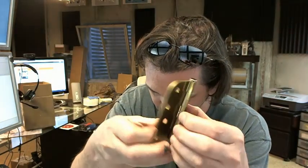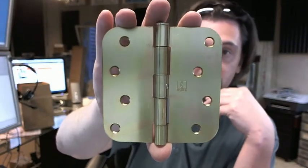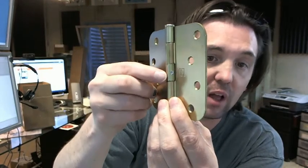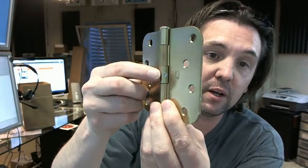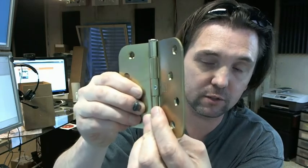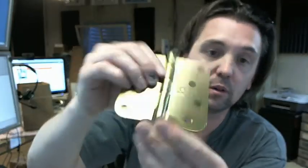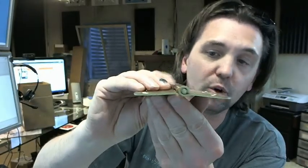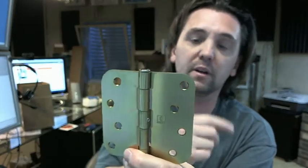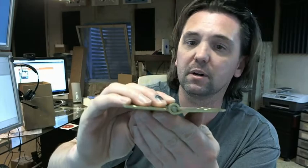This is what the hinge looks like in the US 2D, which is a brass tone. This hinge is shown with the optional non-removable pin, meaning that there is a set screw drilled and tapped into the barrel of this hinge, and when tightened down it will all but eliminate the removal of the pin — driving out the pin from the bottom. There is typically a groove cut in the pin and that set screw seats into that groove, making it all but impossible.